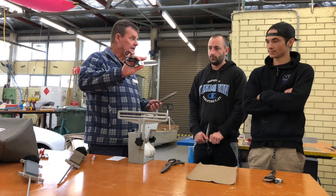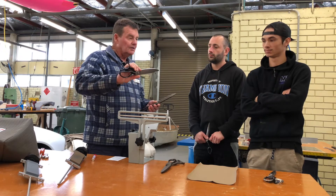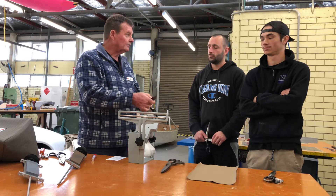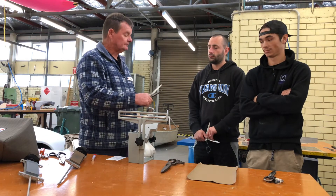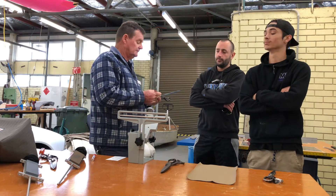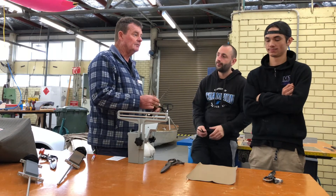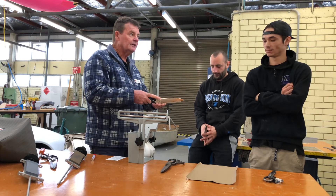We have a brand new pair of shears worth up to $140 to $170 a pair — with a good set we'd like to retain. Here's a pair bought in 1985, some 30 odd years ago, that have been sharpened at different times and have likely lost the set. The beauty with this particular jig is that you don't have to separate the blades. One of the biggest problems with separating blades is losing the spring washer that keeps the tension, which means the blades won't stay at the right tension when they open and cut.